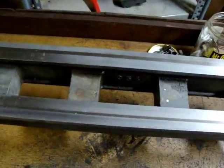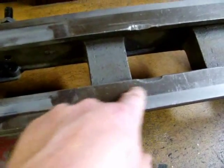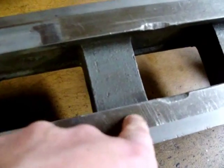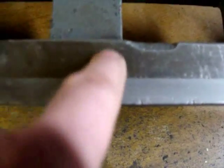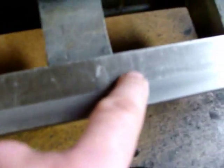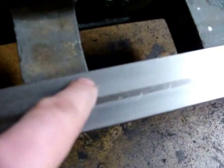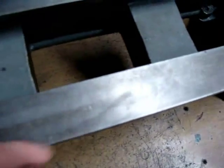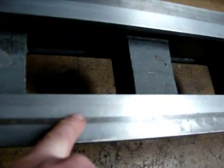Most work is done right in this area, and not much way down at the other end — so consequently there's more wear from the carriage moving back and forth in this zone. With the headstock assembly removed you can see underneath there's virtually no wear because nothing travels on that section. You can actually see those little striations or lines right here, just a ghost of them in this middle area, and then as you get further down they pretty much disappear completely — and then way down at the far end they start to come back in again.